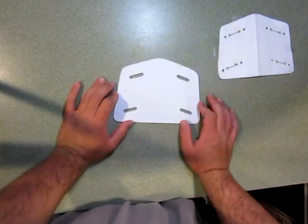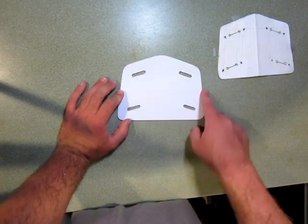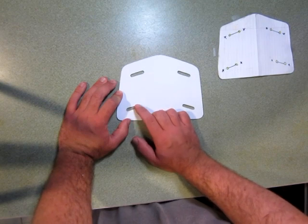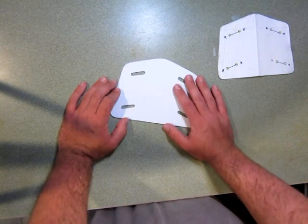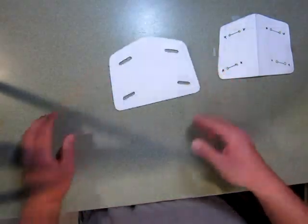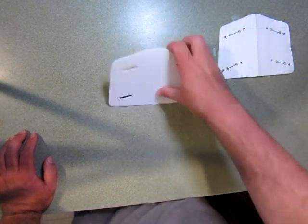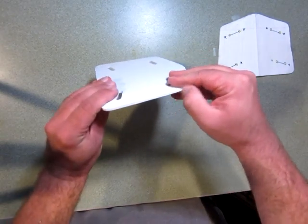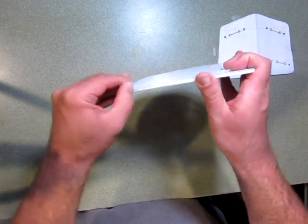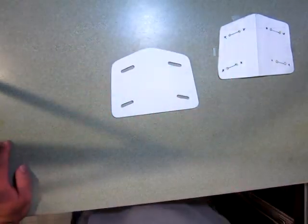Here we have the almost finished product. It was drilled with quarter inch holes, and I connected them using my cutout tool to get the bulk of the material out, then cleaned up the rest with metal files and wood rasps. Kydex is really easy to work with — pretty much any woodworking tool will cut it with no problem, neither damaging the plastic nor the tool. One thing to note: around the edges where I've sanded it got a little discolored. Using a sanding belt moving too quickly will start to melt the plastic and turn it black, and it'll pick up any residue on the sandpaper, so use a clean belt.